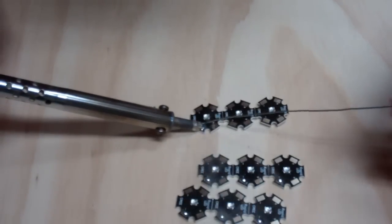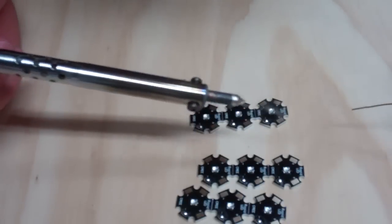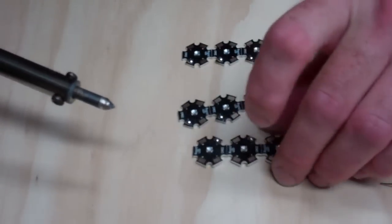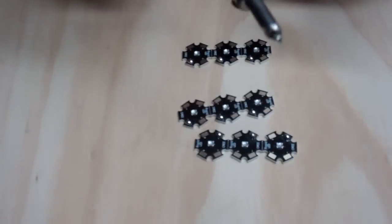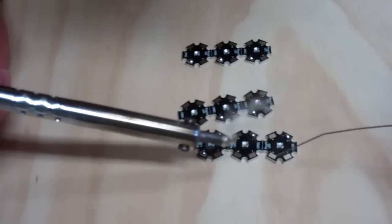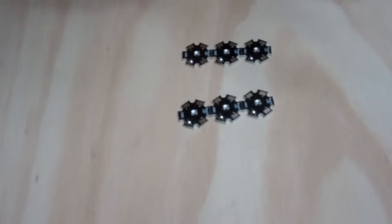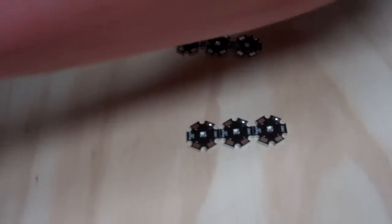The Crees and the Philips have their chip right there exposed. On the Osrams and the Satis, they have a dome over the LED — kind of a little plastic lens, a 120-degree lens or whatever they want to call it. What you do is you heat the pad up enough so that it takes the solder. Remember, you've got to leave enough room for your wire to connect, so when you put your wire on, all you've got to do is touch the bead of the rosin or the solder once your soldering iron is hot and then just shove the wire in place.